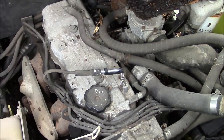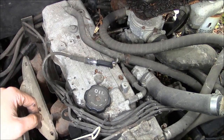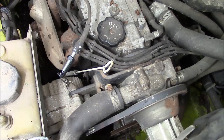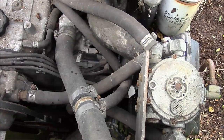All right, I'm gonna go turn the key. Negative. Well, I certainly didn't see a spark, did you guys? I guess there's a chance that that valve cover's not a ground. Let's try it again over here. No spark, and our battery is dying. So there is electricity down here. I'm gonna see if I can hook up a battery charger real quick, if I've got enough extension cords. Well, way down in here is a distributor. I don't know where the coil is. I'm gonna have to tear some stuff apart to find it.